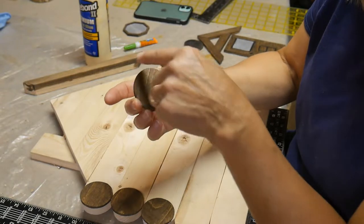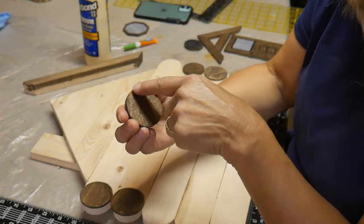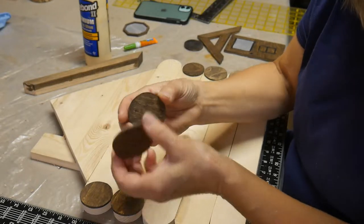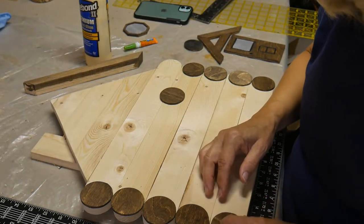What I've done is I drew a circle on here, stack cut it three thick, cut it on the scroll saw close to the line, and then take it over to my sander to get a more perfect round shape up to that line. And I've stained these walnut.